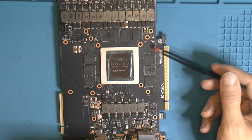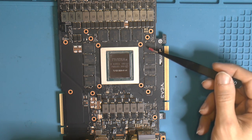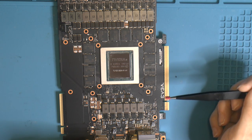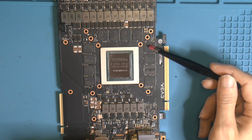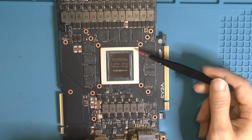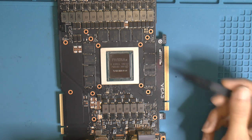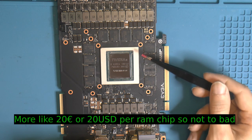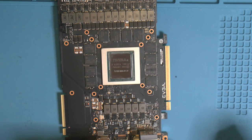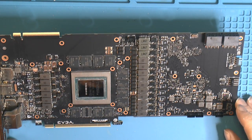So this is Samsung. So it's apparently quite likely that all you need to do is reball a problematic chip. So we need to take this one off, reball it, put it back on again. So this is B0, where the problem is. But there could also be that the memory controller for this channel is actually broken. Then we have a brick. And if the reball doesn't work, we could buy a new chip. They're quite expensive, I think it was like 30-40 euros for a chip. I don't have one, because I'm not gonna buy one unless I have to. So if we have to put one on there, and that works, I suppose. Some editing will remove that time delay for you, but not for me. So I suppose the next thing to do is actually just to remove this chip.